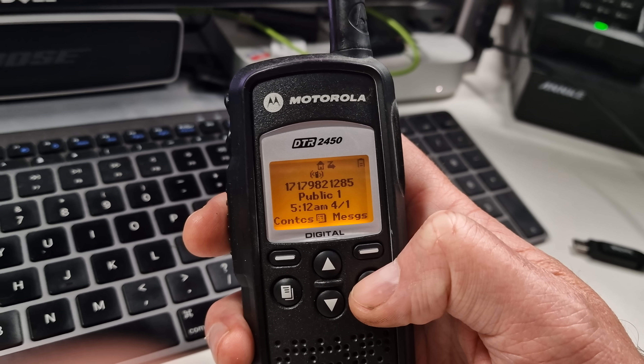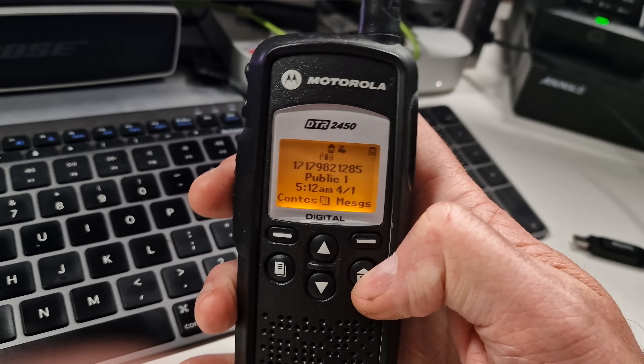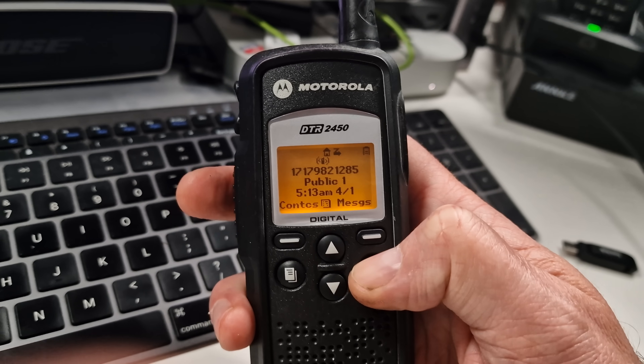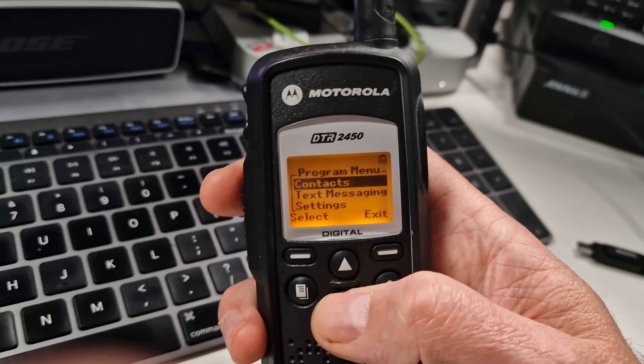The other thing is there's no way to listen to or eavesdrop on these radios unless you've got another one of these radios. So being that they're so rare now — although at the time of making this video there are about seven or eight on eBay — that's going to make it even harder to intercept them. But what if you did have one and you were near somebody else that was using these as well? Could you actually listen and maybe even communicate with that group? It turns out yes, you can, because as standard these are programmed in a public mode. So whilst they're so stealth on one side, they're actually wide open on the other side. But they can also do private calls as well. There is actually some programming software available, and the radios normally come with an 11-digit ID which is different for every radio. You can access some front panel programming by holding down the home button, hit the PTT three times, that button, that button, that button, then do three PTTs and you get into the program menu.